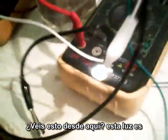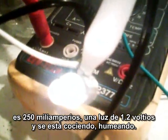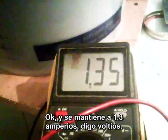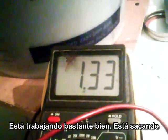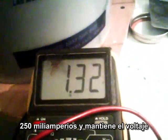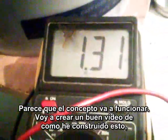This little light right here is a blinding light — it's a 250 milliamp, 1.2 volt light. It's just cooking, smoking hot, bright, and it's holding at 1.35 volts. So it's working pretty good. It's putting out 250 milliamps and holding the voltage on a charge that's only been 30 minutes since the battery was built.